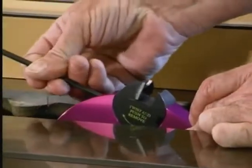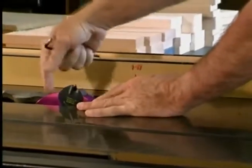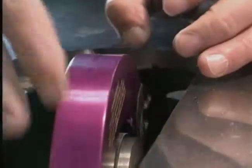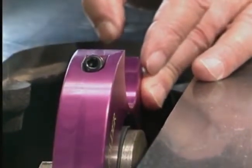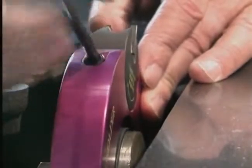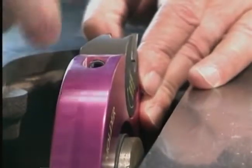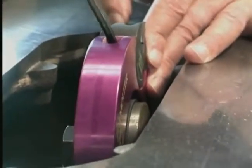This makes the details on the plugs align themselves to each other. This creates smoother cuts, longer life, and eliminates any concern of installing the cutters incorrectly. No dial indicator is required to align the detail plugs. Always install identical plugs in each cavity — mixing plugs will cause an imbalance and create vibration. All plugs and heads are electronically spin-balanced for vibration-free operation.